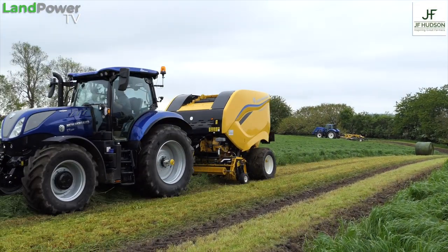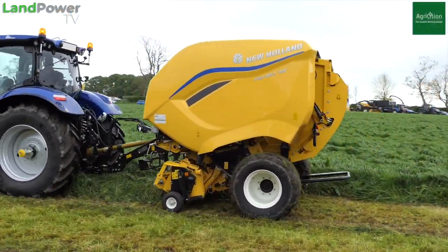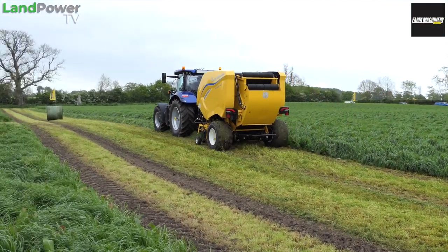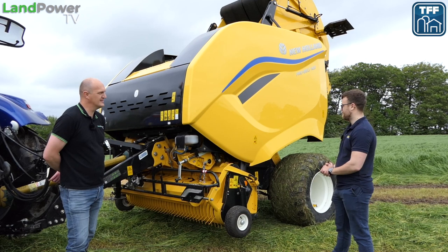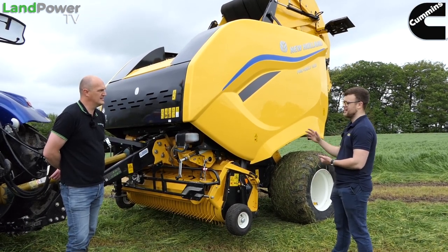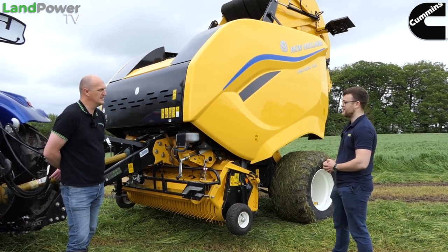So it is a system that basically the baler controls the tractor. So it'll control forward speed, etc., bale drop-off. So open, close, and away again. That feature, you can get it through parts. You just need a sensor on the tailgate and then an activation code through the screen. Right. So it's a very, very good feature to have.